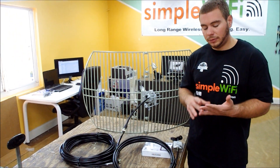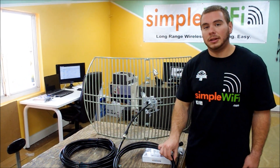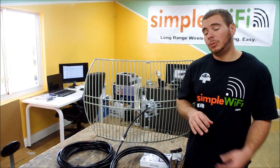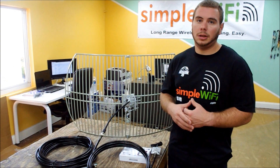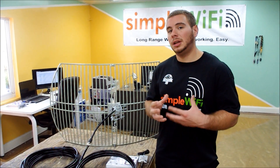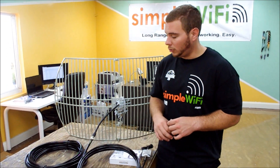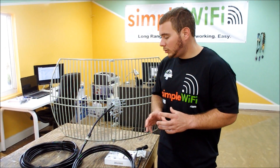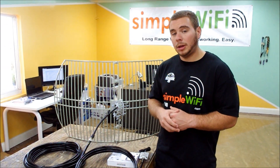When choosing your cable length, we leave it up to you — twenty, forty, sixty, even a hundred feet are available. The most important factor is thickness. We don't recommend anything other than LMR 400 cable. Unless your budget is tight, you can go with LMR 240, but we really don't recommend it because it is very lossy and not as thick as the LMR 400.